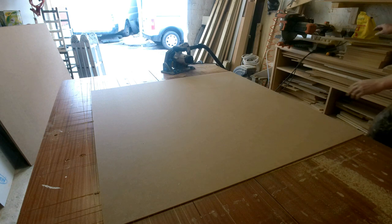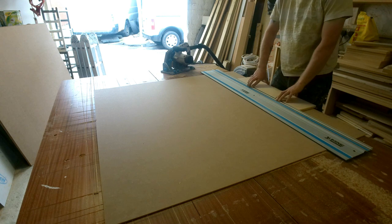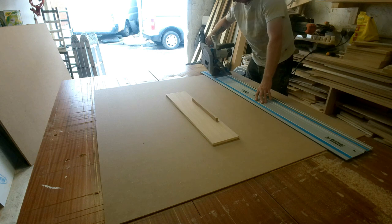I'm going to show you the process of cutting them down — how easy and quick it is to save yourself an absolute fortune. I'll stick links to all the tools in the description below so you can get similar ones. The process I use is quite simple. I made a quick little jig out of some scrap plywood and MDF, and this measures exactly 30 centimeters from the back of my track to the cut side of my track saw. This helps me break them down to 300mm width, and then I go over to my table saw and use the table saw sled.